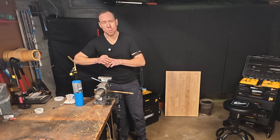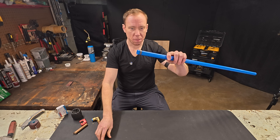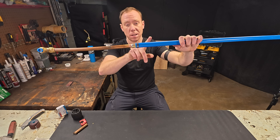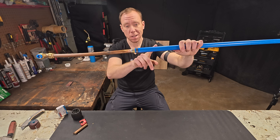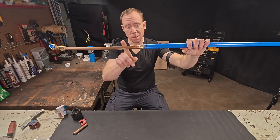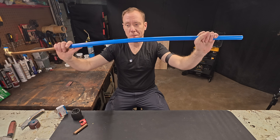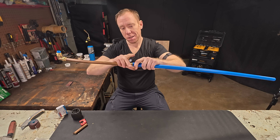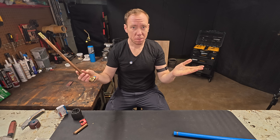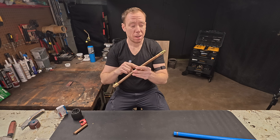I'll leave a link for all these things in the description. Here we have the finished solder fitting, ready to go to PEX. I've got my crimp ring here — this is half-inch copper to three-quarter PEX for an equal ratio. If you're looking to downsize, you can go to half-inch PEX. But for equivalent flow rates, half-inch copper to three-quarter PEX is the way to go — crimp it and you're good. PEX is awesome because you can bend it and stretch it, and it's way easier to work with than copper. If you're looking to re-pipe your house from galvanized or have just a little bit of copper, I would definitely go to PEX.